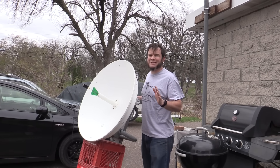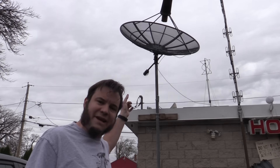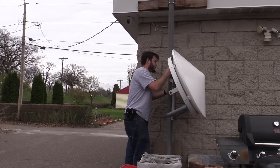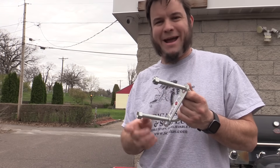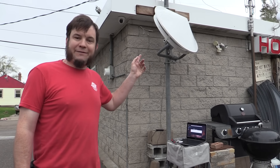This is working a lot better, although it's super windy outside — I always pick the best days to do this. I'm going to swap out this feed and put the antenna on the same pole as my big GOES East antenna since I have all the mounting hardware for a pole. I'll aim them both the same place for now, and later maybe switch one over to GOES West. The U-bolts turned out to be for a bigger diameter pole, so I had to swap things around. While adjusting the vertical screw to change the dish elevation, instead of pulling the dish up it was warping the dish and breaking things. I got it bent back into shape and mounted differently so I can adjust the elevation.